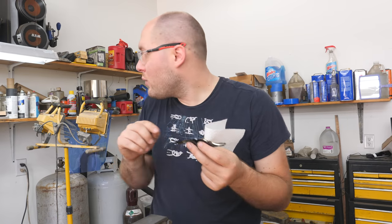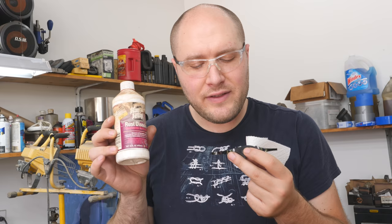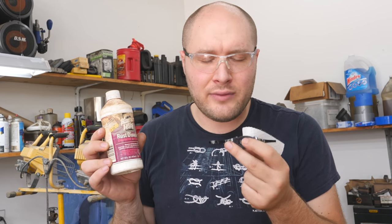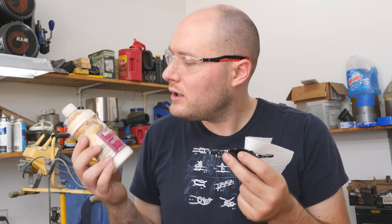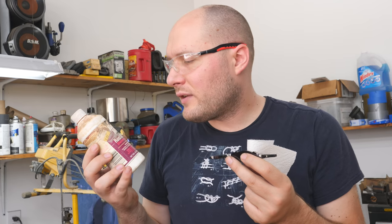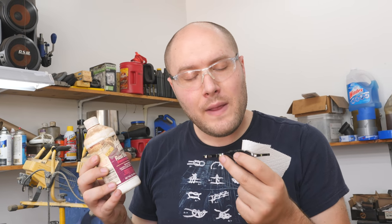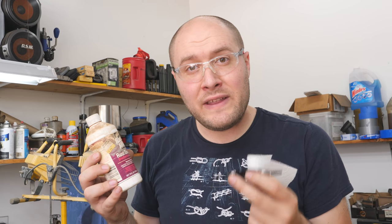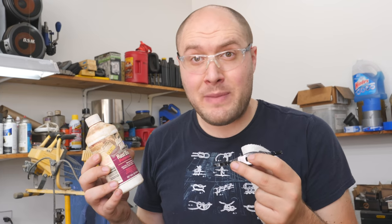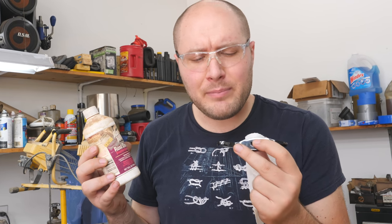I'm gonna strip the bluing with some Naval Jelly rust dissolver. This will take the bluing off. Because if you try to sand the bluing off, it's actually a really thick layer and it would take a lot of sanding to get all the bluing off. So I'll use this to get the bluing off and then it'll be kind of gray when we're done. So I'll have to lightly go over it with the 3000 grit and sand the piece again. And then buff it and then we'll go back through the bluing, only this time I'm going to wash it with some soapy water and then put it in a brand new fresh batch of the chemical cleaner and do everything else probably the same.